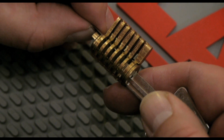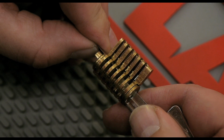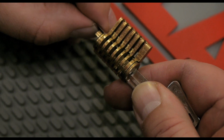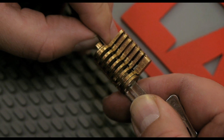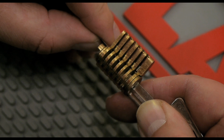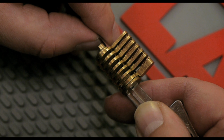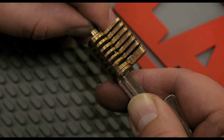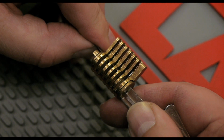Now we're hung up right up there. Now you see we're hung up on the third there. We're hung up on one of the bottom pin. Sometimes we're hung up on it because the shim's not going in. There, we can tell that's a clear spot. When it just goes in a little bit, we know we've hung up. There, we've hung up on the mushroom pin. So then just back off.